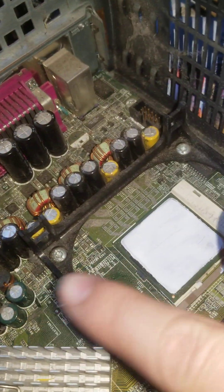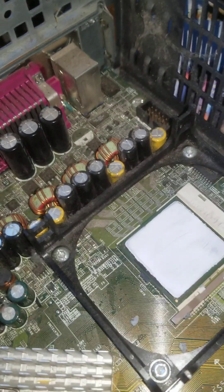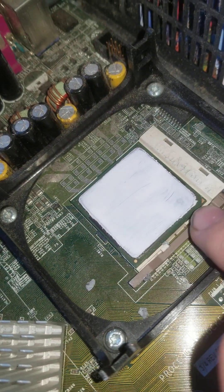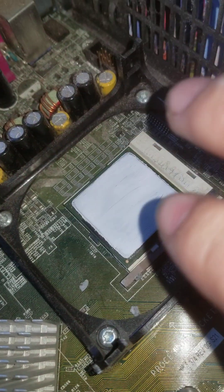If you're getting loads of heat sink compound on your finger after spreading, you've put too much on. In that case, wipe the excess off and start again. If you're getting a lot of overlap on the edges, you've also put too much on.